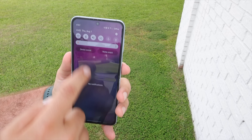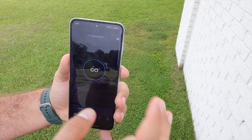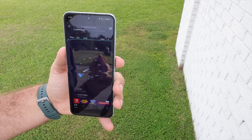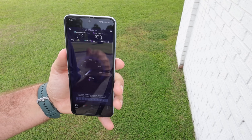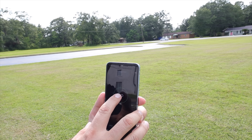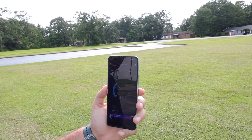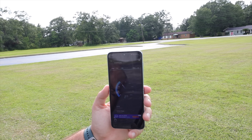Now over here in the courtyard area on the AP27, we'll go ahead and run a speed test and see what the difference is. We're getting essentially the full speed we're paying for — we're paying for 100 meg, and we're getting right at 94-95 down and 98 up. Definitely a huge improvement in this courtyard area. Out at the edge of the field where we do the farmer's market setup, this would be internet for all the businesses that come out here. We're pulling 40-45, upwards of 50 megabits per second right out here in this field, which is great — plenty of speed for those businesses.